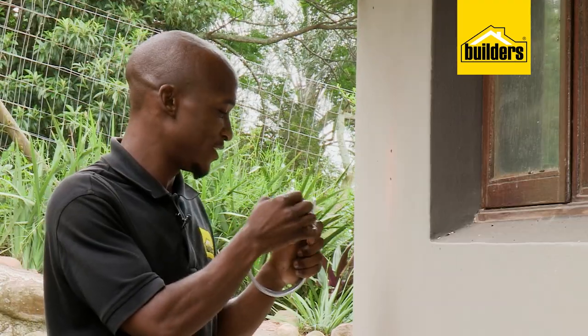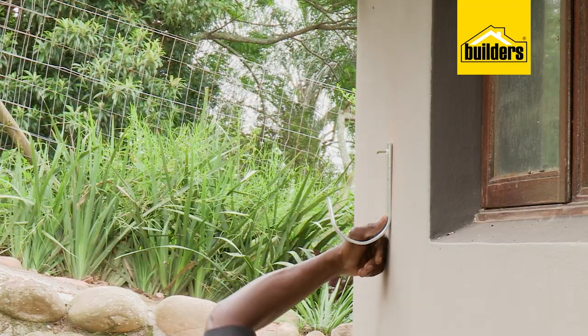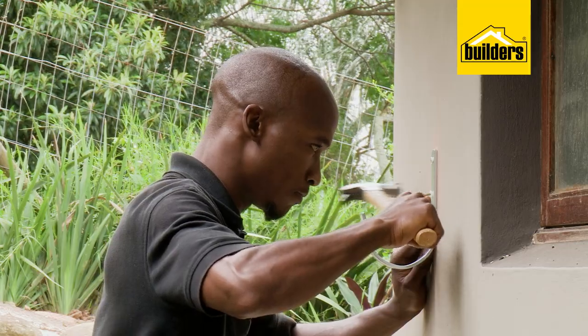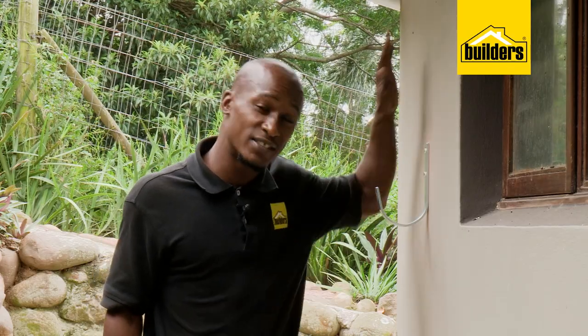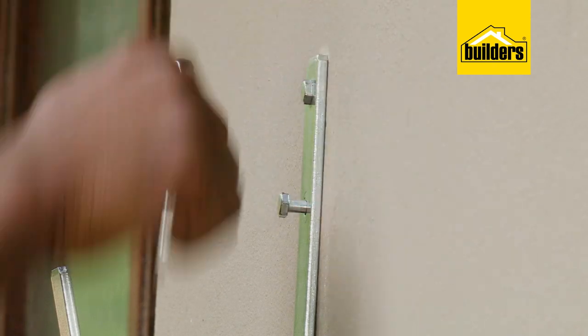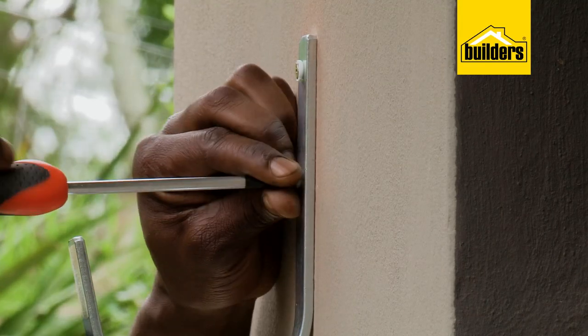The second bracket I'm going to be installing using a nail-in anchor. So hole drilled, I'm going to put the nail-in anchor into the hole in the bracket and into the wall before hammering it in. Notice how the nail and anchor are one. So hypothetically, it's five years down the line and I want to remove these brackets to paint the wall. The screw-in anchor comes out easily, while the nail-in — while it was quicker to install — doesn't come out that easily.